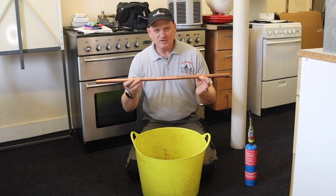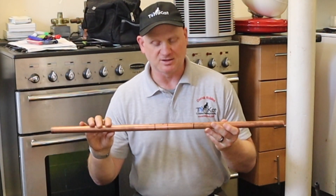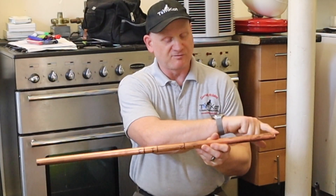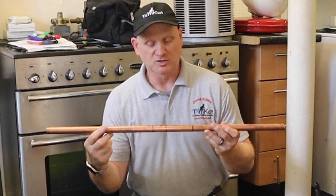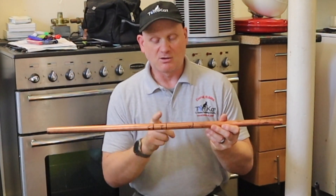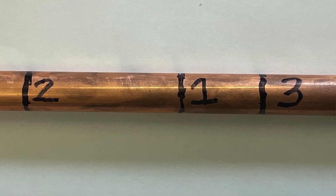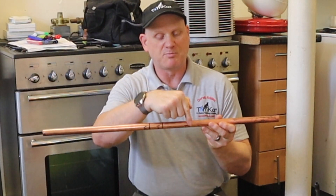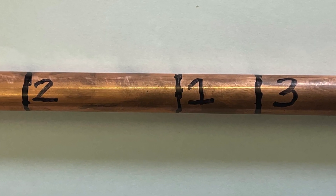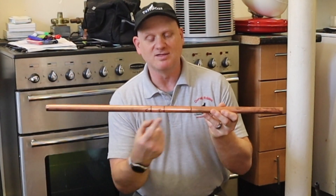If you have seen part 1, you have seen you have to have markings for your bending radius. I have measured 400mm because this is the centre of this pipe — 400mm from the measured end to my centre point. Number 1 is my centre of bend. I have gone back 4 pipe diameters: 4 times 22 is 88mm. And I have gone forward 2 pipe diameters, so 44mm forward. This is where I am going to bend my 90 degree within those marks.